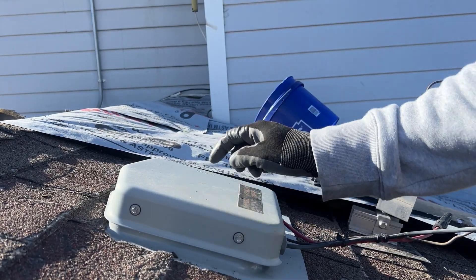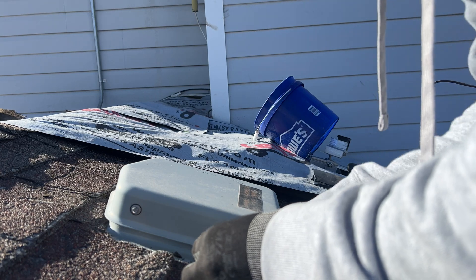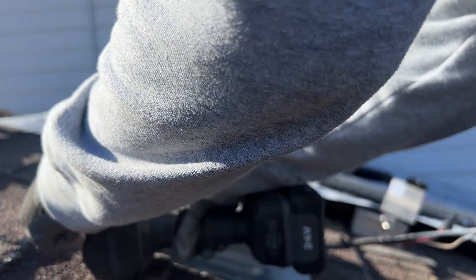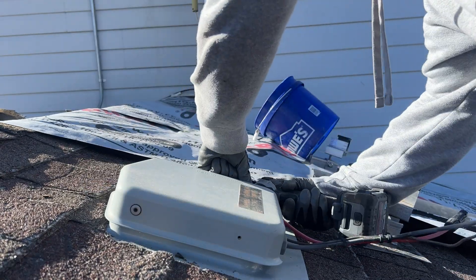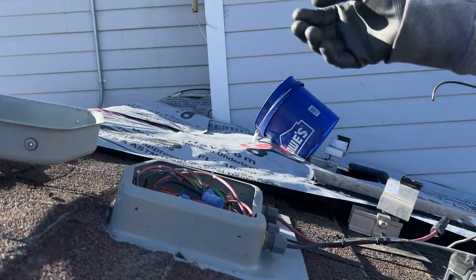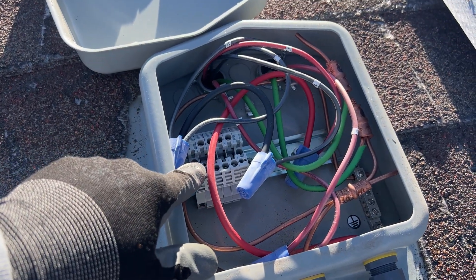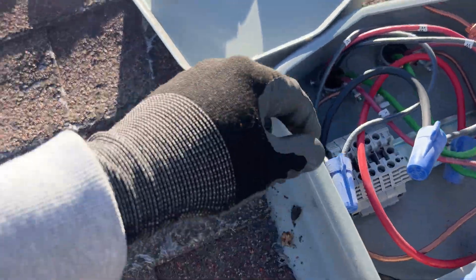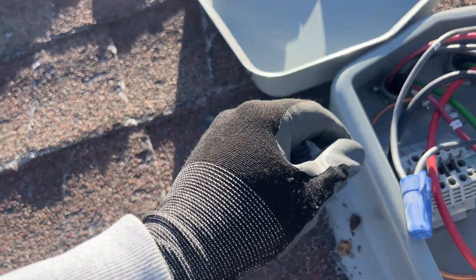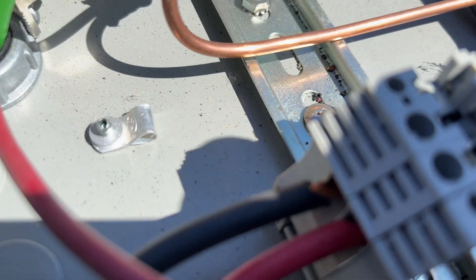Sometimes you'll see electrical issues inside these boxes. Just to verify, I did turn off electricity to the system. Looks like we have some terminal blocks in here that were not used, and then everything's just in wire nuts. I'm going to pull around on these since I know it's all off. Nothing's burnt up, no apparent problems. I might actually just switch over to those terminal blocks on that little gem right there.